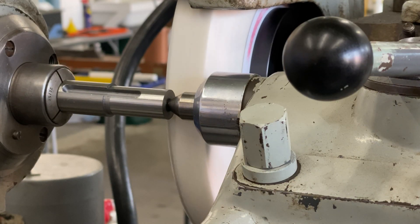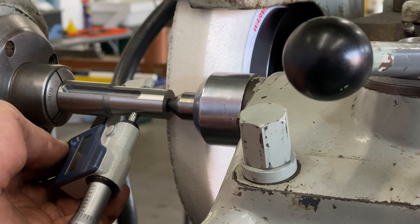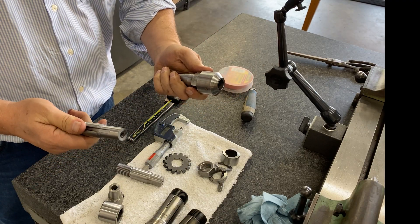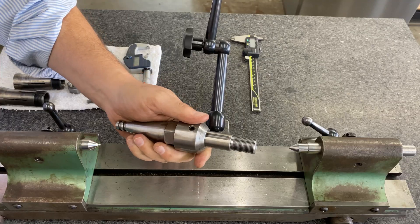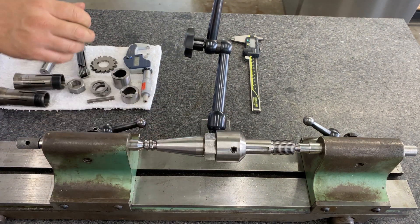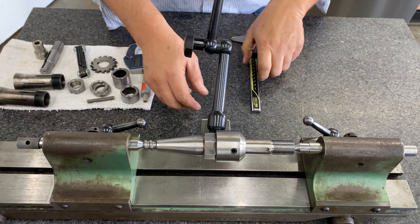Once you get to the end here, let's give it another measurement — I think we're through the run now. This may be a little warm, but let's check it and move our work along. There we go — now let's take it over to the bench and insert it in the Moore arbor and see how well it fits. Bam — perfect! Sounded good. That is definitely a nice precision fit — that's awesome. The arbor's ready to go. Let's take it back to our tester and test it again between centers, all mocked up with the tool and the arbor, and let's see how good we are.